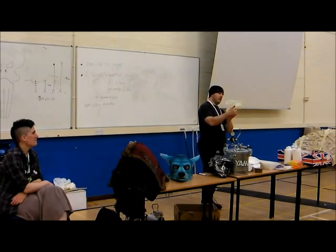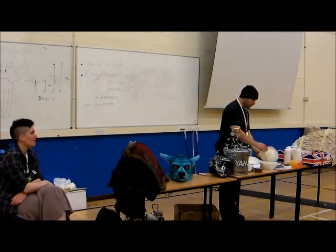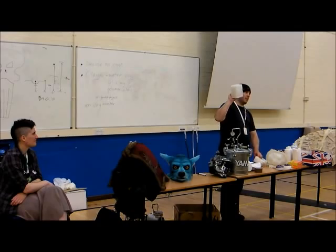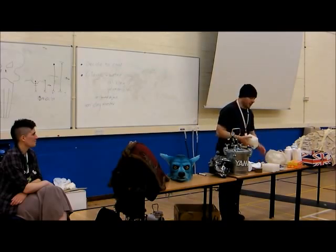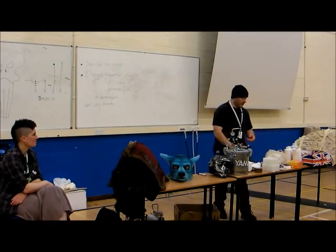So you basically have two choices. Either you make a block mould out of silicon, which will cost you about £100. This thing costs £100. That is a block mould. Basically, I have taken an object which looked like that, put big walls around it, poured it in, glued, solid thing. There's a reason for doing a block mould for this thing that I'll explain. So that's a block mould.